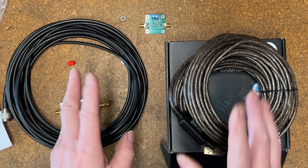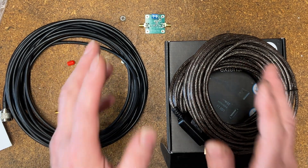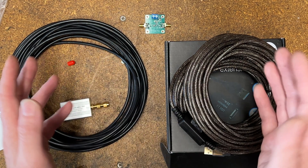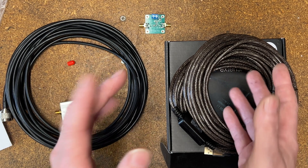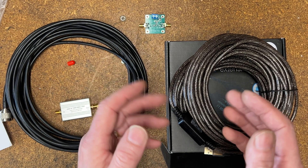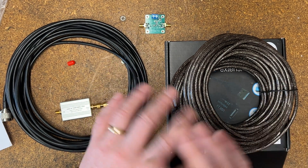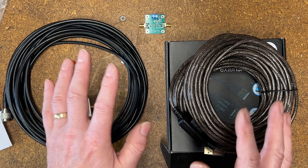Basically I did a test to start with between a 60 centimeter antenna and a 1.2 meter antenna. There is a difference — there was an increase. Depending on what you're looking at in the flight scene, we were up by 6%. Overall hits and positions reported were up by 13%. That was just a straight antenna swap.